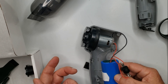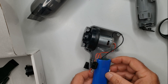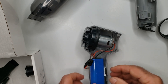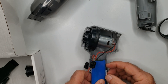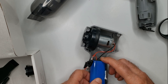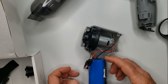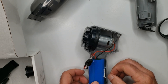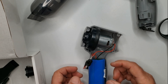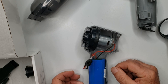No safety circuit, nothing in there — which you'd typically find with two lithium cells. I went ahead and put it on my bench charger and it just shows 3.9 volts and says it's fully charged. It wouldn't allow me to do anything useful, so something's not right here. I'm going to open up this cell, see what we've got, and maybe even replace it with some cells I have here to see if we can make this actually do something.